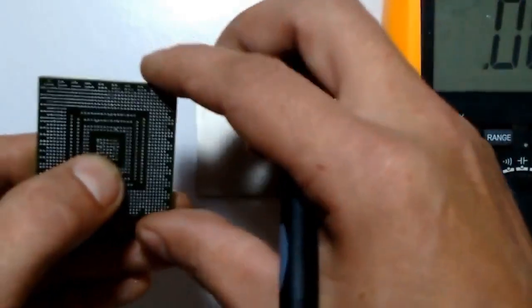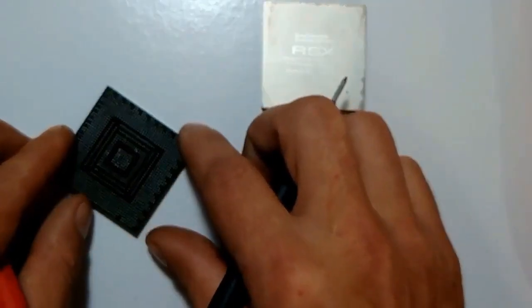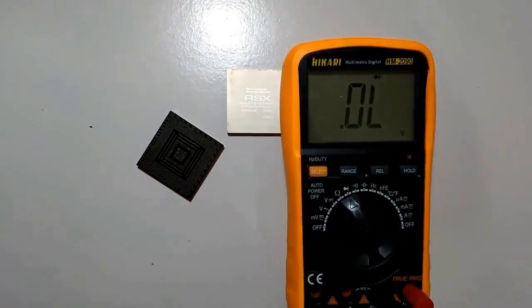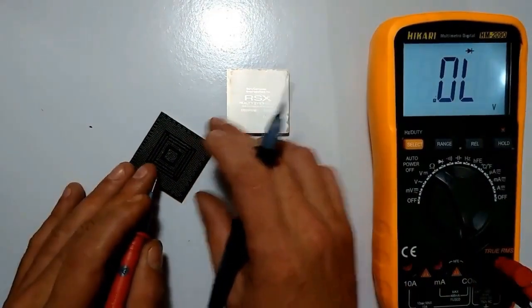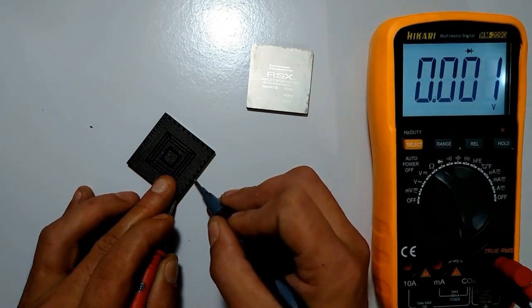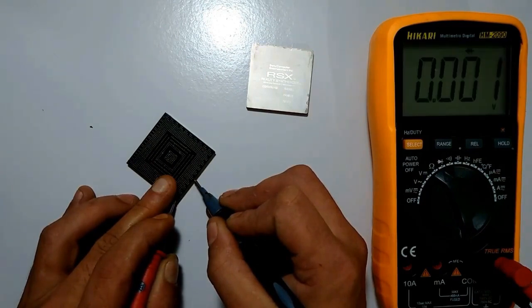Let's see if we can get it here to check. I'll place it a little diagonally here to make it easier for me to grab. Okay? Wow. It's fine, but just so you can take a look. It will indicate a short circuit here. I'll go back a bit on the image here because it's getting quite blurry. Okay? So let's go. I will take the middle ball here. 1, 2, 3, 4, 5th block. I take the other ball. Oh, do you see? I have a short circuit at these 2 points, right? I can't have this short circuit here.